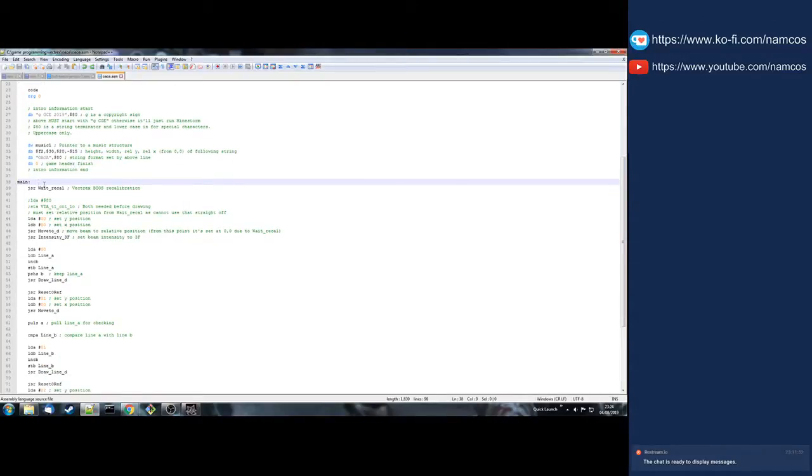And then you've got the recal, which basically resets the beam to the middle, and then you can start putting stuff in. So here I've done load into register 0, load into another register 0, and then use this, which moves the beam to a relative position. Then you can set the intensity of the beam, so you can have a brighter beam or anything like that.